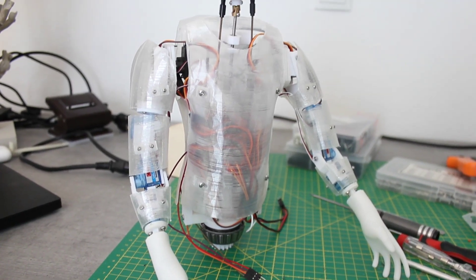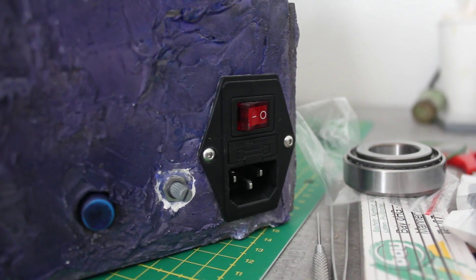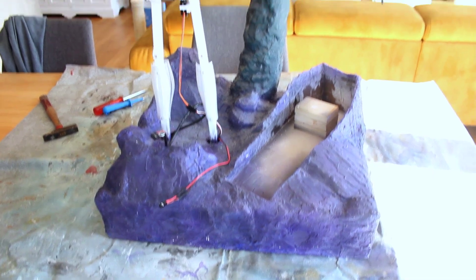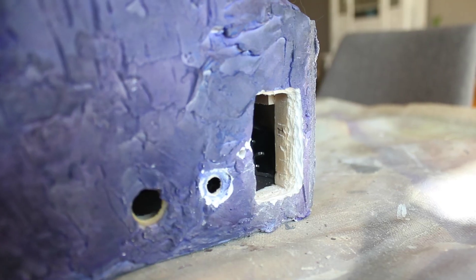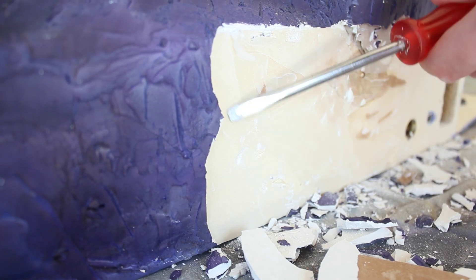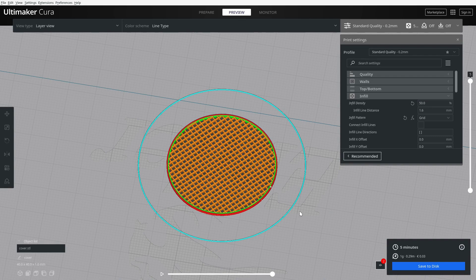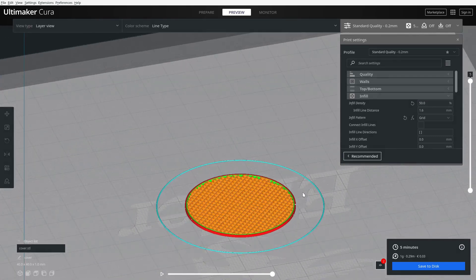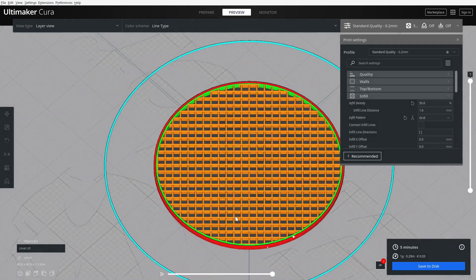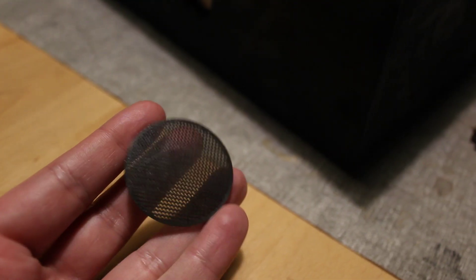On top of the more technical upgrades, I also wanted to do something about the box, which was completely covered in plaster. I realized I would prefer a clean edge between the sides and the top of the box, so I began to remove the plaster and put on some wood filler where necessary. To create some speaker grills, I used a simple trick in the 3D slicing tool Cura by choosing an option to print only the infill of a thin disc. Using a grid pattern, I received a perfect speaker grill right off the 3D printer.